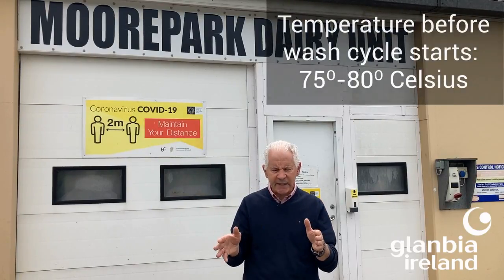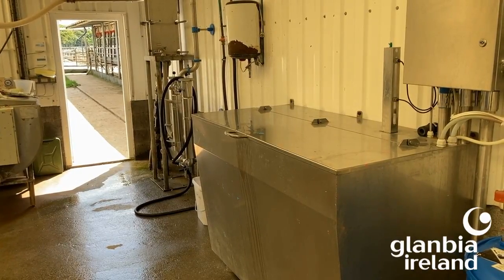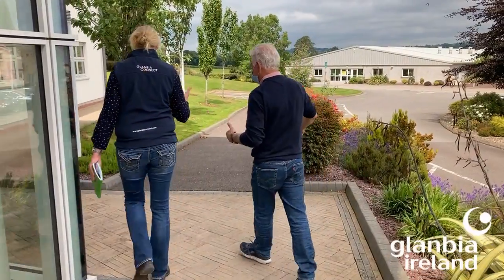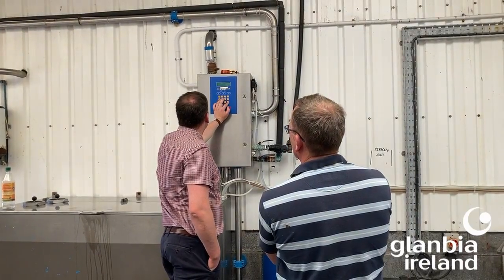The wash cycle itself should be about 8 or 9 minutes — it doesn't need to go on for 15 to 20 minutes. A lot of automatic washers have a facility to allow the first amount of hot water circulation — maybe 10 to 20 litres — to be dumped, because that initial water is cold water sitting in the system. This is a key feature that many farmers have but don't realize, and with a few adjustments their service people can enable that 10 to 15 litres to go to waste before detergent comes in.